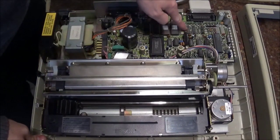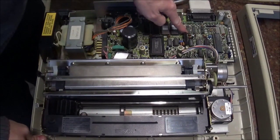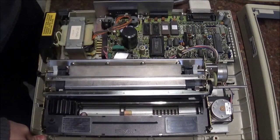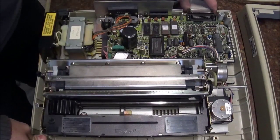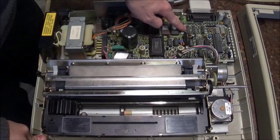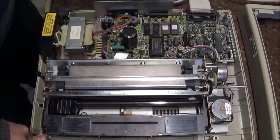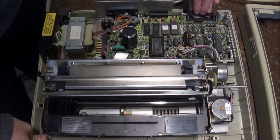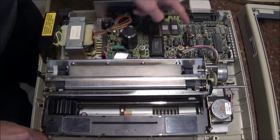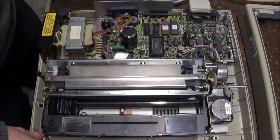Up here we see two 74-series chips, which are actually two asynchronous buffers that are signalled by the strobe signal coming from the control computer — they appear to be the input data buffers. They'll take the 8-bit data bus and latch it when the strobe signal is toggled, and then the CPUs can read the data at their own speed.